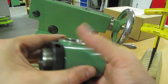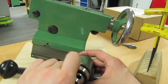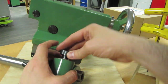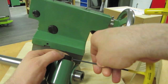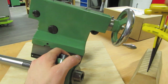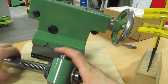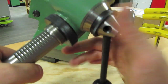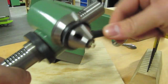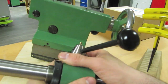I think it went that way — yes. So we first insert the bar, then insert that and engage the teeth, and then reapply our little collar. I've got a sneaking suspicion that this is a metric fitting — it's classic late British engineering where you've got mixed fastenings: metric and imperial fastenings all on the same machine tool. It's a bit juddering at the moment because we're not working in the right orientation, but you can see how that handle will drive pretty quickly the advance of this bar. It's got quite a rapid lead.